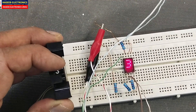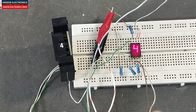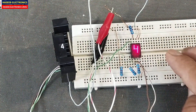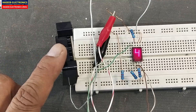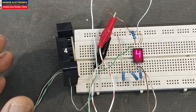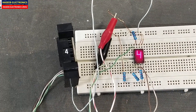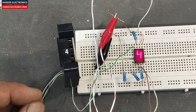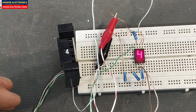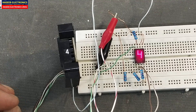One, two, three, four. In this way we can configure this thumbwheel switch to display its data directly on an alphanumeric display. If you want to display this BCD hexadecimal data on a seven-segment display, at that time we need a BCD to seven-segment decoder. But here we are displaying directly, or we can integrate with the 74175 D-latch. I hope this video is informative — if so, hit the like button. If you have any questions, let me know in the comments. Thanks for watching. Assalamu alaikum warahmatullahi wabarakatuh.